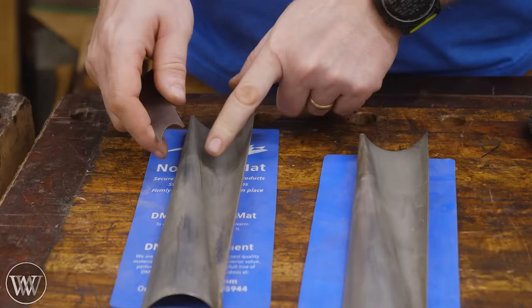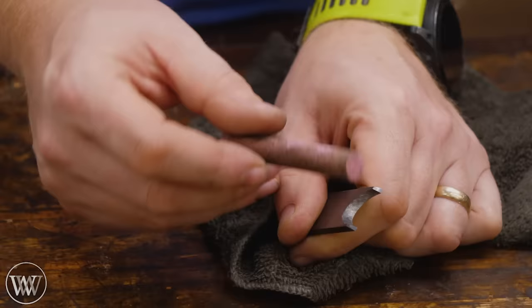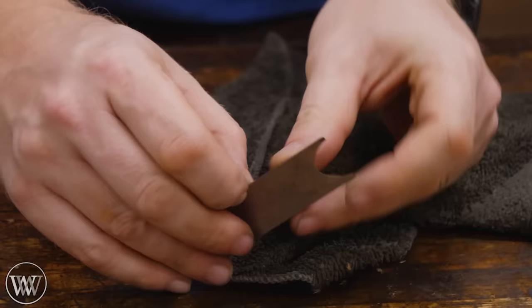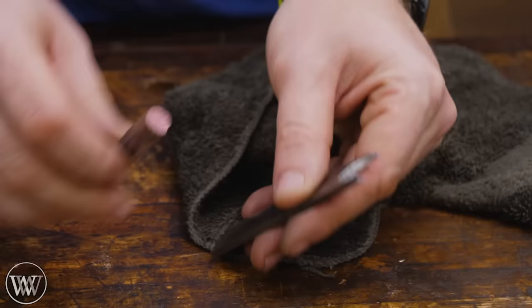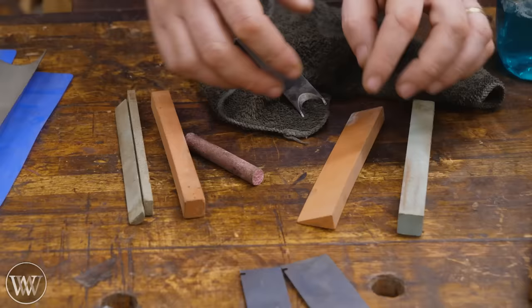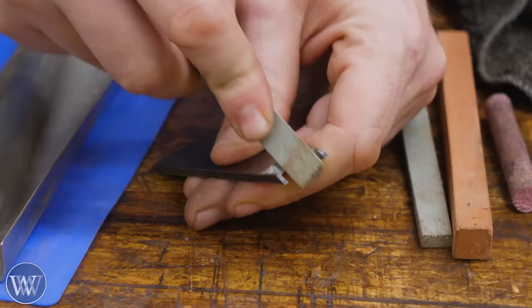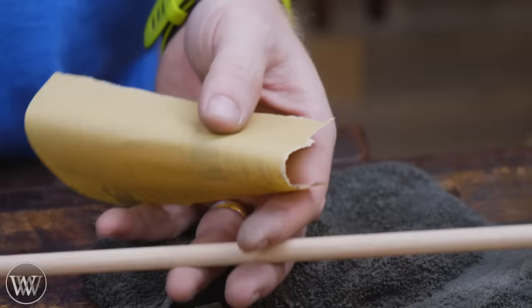But what do I do with the inside? The inside doesn't exactly fit on a plate — I can't get that rounded surface in there. Sometimes I can use these DMT waves; you just find the spot that's the right radius and work that little spot just a little bit. But for something this deep, I generally don't like using the waves. The traditional method is to grab a slipstone and grind it down. Now remember, this may look like an oval, but it's actually a circular shape at a 45-degree cutting angle. So my slipstone needs to be at 45 degrees and goes all the way up the side. I'm not tipping it in or out — just keeping it at 45 degrees. But a good set of slipstones: they're expensive, they break easily, they're slow. And finding the right profile can often be a pain, though there is something nice and almost nostalgic about using a slipstone.